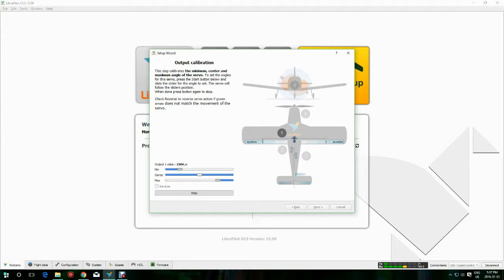So if you have a little bit of aileron trimmed in, you want to make sure you replicate that with the centering. Same thing with the elevator — I had to come back and re-center it with a little bit of up elevator centered in because my nose wanted to drop in flight. What you don't see here is the actual control surfaces moving on the plane while I'm adjusting these servos — you're actually doing this live. Same with the rudder: if you have a little bit of trim on your rudder to get it flying right, then center it in that position so that without any control input, it's flying nice and straight.